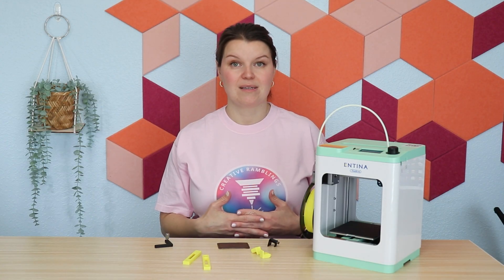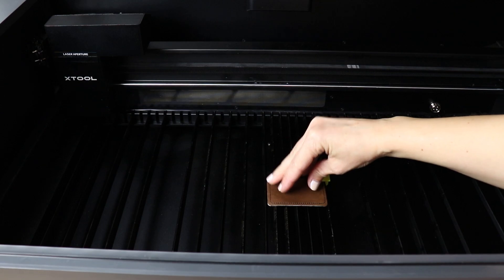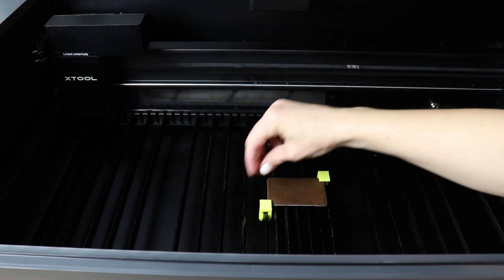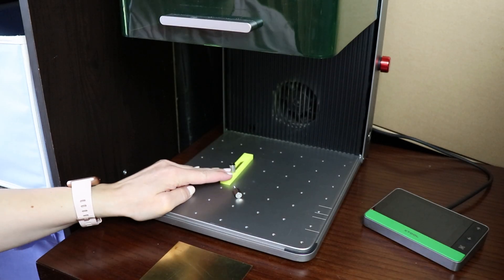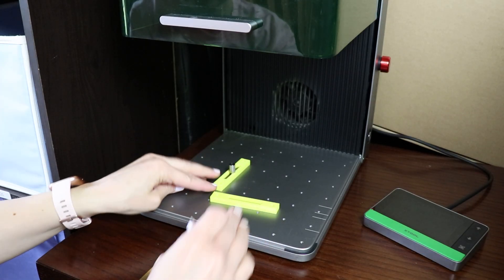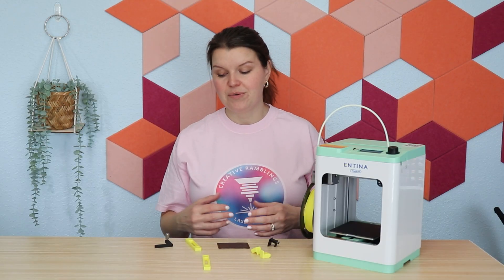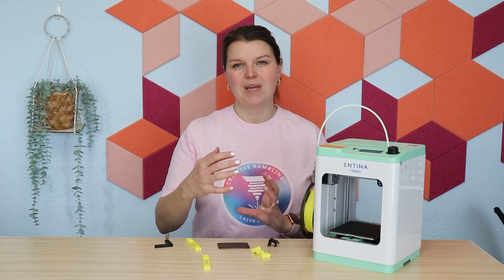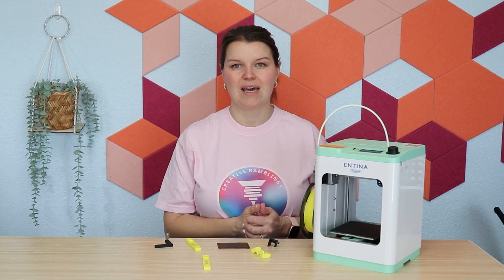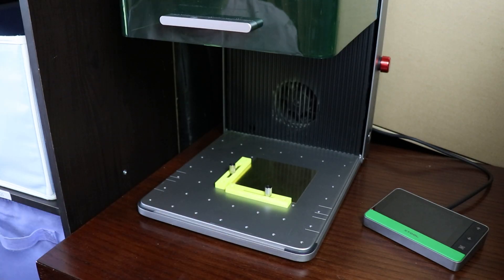So let me show you how I use these in my machines. In the P2S, I can put the hat patch directly on the slats. I do like to move the slats a little bit closer together so there aren't as many gaps, and then I just pop the clips on and it holds my patch in place. On the F1 Ultra, I can put these jigs in — there is a long piece in the middle so I can slide each one where I want it, meaning I can put my material to be engraved directly in the middle. Sometimes when you use the original corner bracket that came with the F1 Ultra, you wouldn't be able to get it directly under the focus dots. These two jigs together work really well, and I'm able to use those two original screws that came with the laser. I can easily engrave my piece, and then when it's done, pull that piece out, put the next one in — I'm not reframing, I'm not refocusing. I can very quickly make a lot of pieces using these jigs.